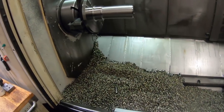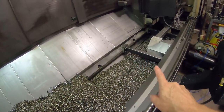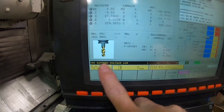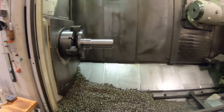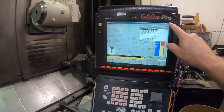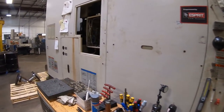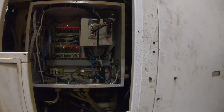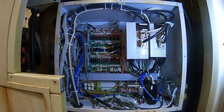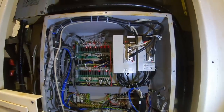I was making this video on this part here during the roughing, and I've got to shovel the shavings out because the chip conveyor still isn't functioning. When I turned the machine on this morning I got this low battery alarm. Now typically on the Mazak, a low battery alarm can mean one of three things: it can mean there are low batteries in the control, but I just replaced them recently so I know it's not that, or it can be these servo drives on the tool changer.